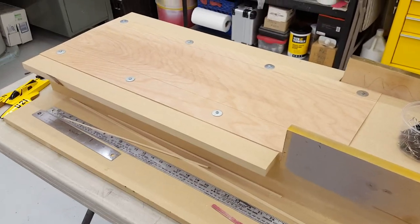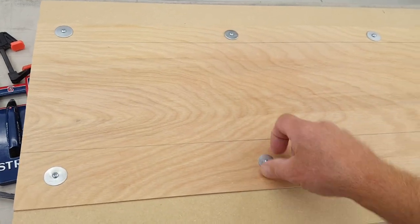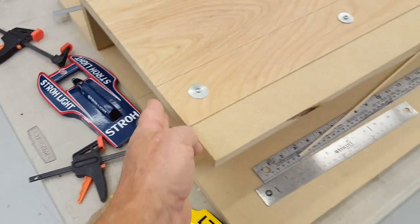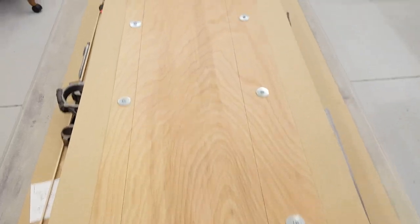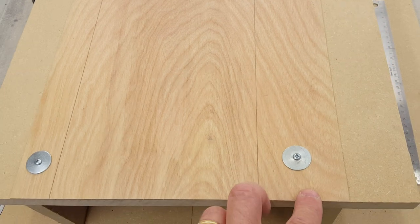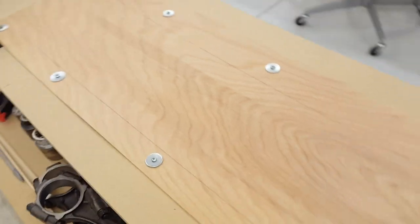If you watched my last video on how to construct a jig, I talked about how we're going to mount the floor section. As you can see, I just run a bunch of screws in it with some big washers — you just want to snug them just till you feel the washer gets snug. You don't want to go in there and crank real hard because then you'll create a divot in it. I made the back of my jig beautifully square using a very large square, measured my center — this guy's dead nut centered and beautifully straight — and then I've marked where my engine well rails go. Mark on the outside of the rail, by the way; if you mark on the inside you'll see it later if you're leaving a wood-finished interior.